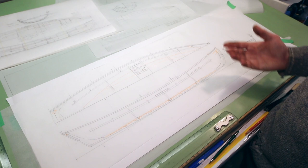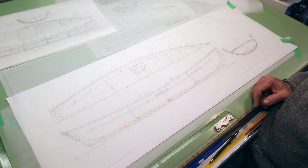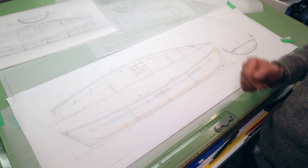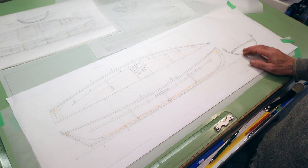Unless I decide to glass the planks before installation. I haven't decided on that. We'll glue on that hardwood bottom. And should it need repairs, you do that by doing a Dutchman. Or you could just shave the whole thing down with the power plane and reskin it with more hardwood. So that's where we're at. I'm ready to loft because I've got my offsets done. I'll set up my lofting board and we'll get cracking on this one.